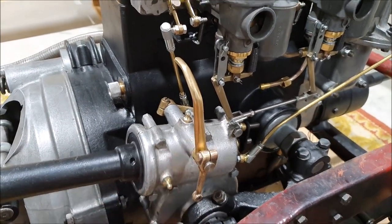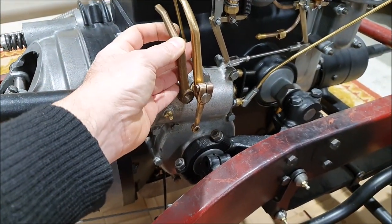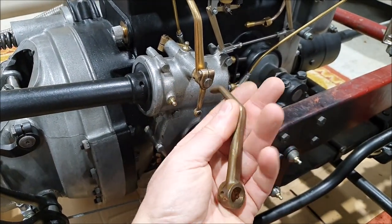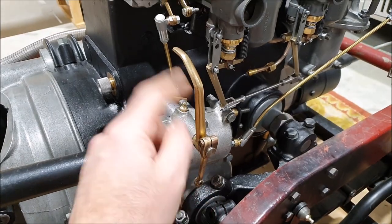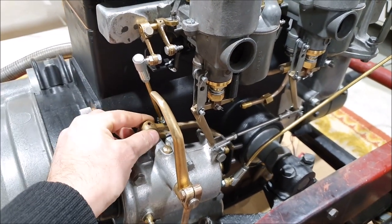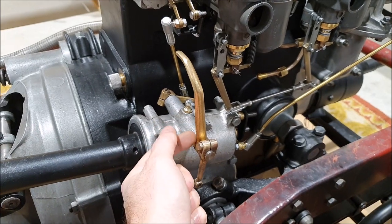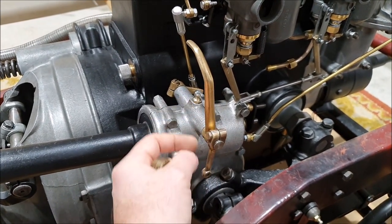This is a bit backwards at the moment. The first thing to note is there are different versions of these parts and you have to get the right ones to work with each other. This is the lever for the hand throttle — this one looks the same as this one but this one is actually longer. The way I've got this set up at the moment, this is actually backwards. So this lever goes on this side. It's actually pinned to the shaft — that's why it's sitting through there in this direction — normally with a taper pin, but I've drilled it out, replaced the shaft, and fitted a roll pin to hold that arm in place.